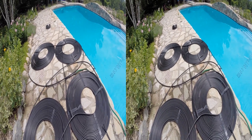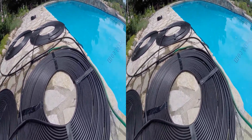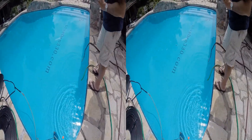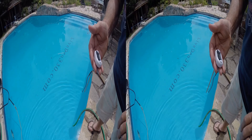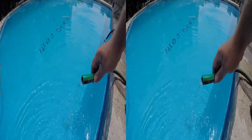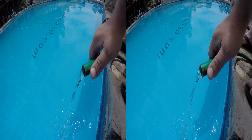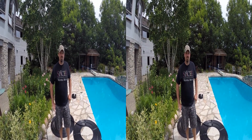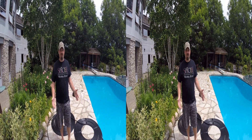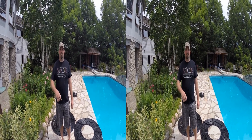Each coil is 200 feet of hose, so with four coils that's 800 feet of garden hose total. Super cheap, nothing to it — it just absorbs heat and transfers it to the water. We were getting 76-degree water coming out of the system when it was 68 degrees inside. With two coils we had a 3.5-degree increase in temperature; with four coils it's a 7-degree gain. That makes sense — and a 7-degree rise, pumping all day for a couple of days, you're going to have a warm pool.